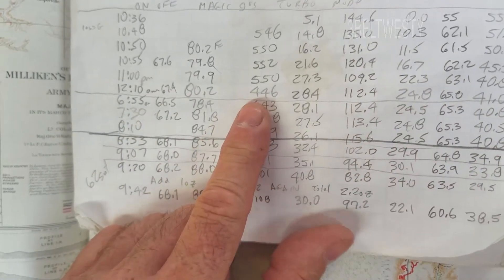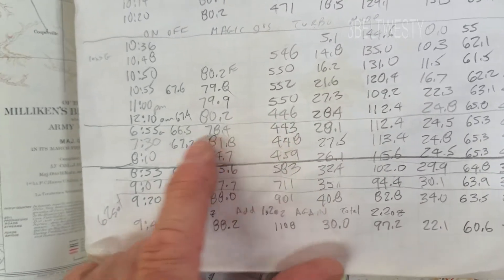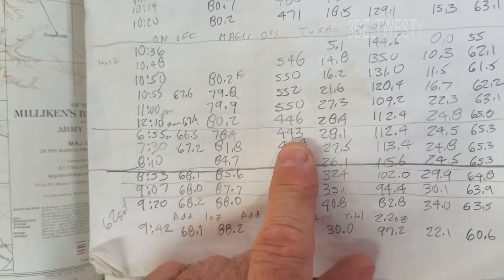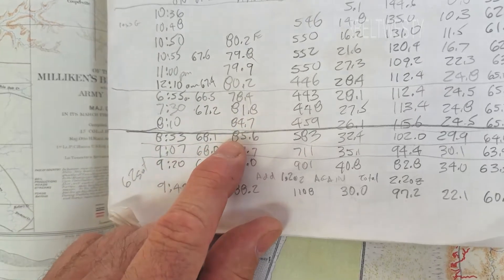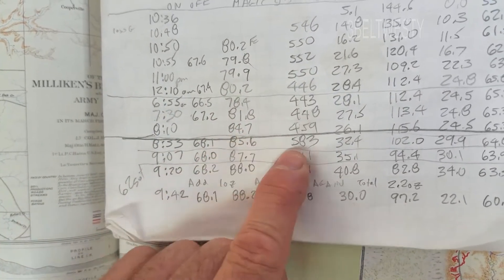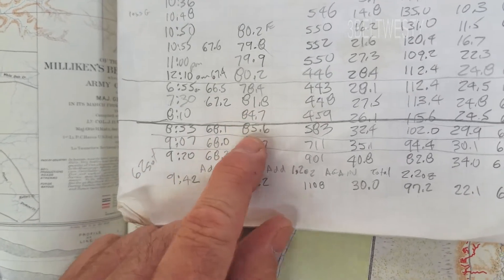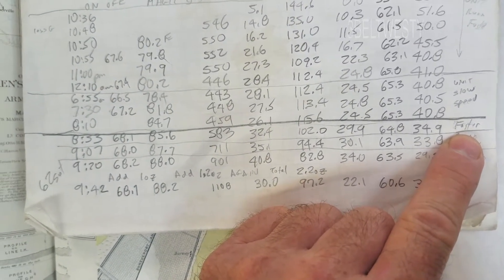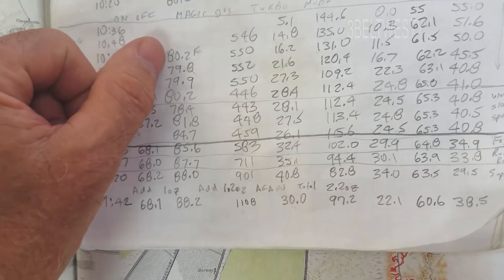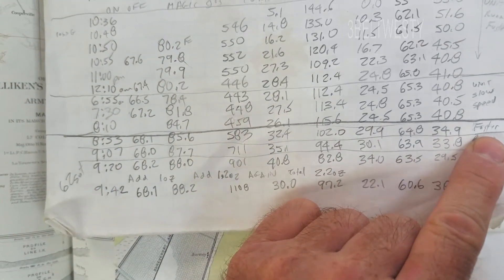The unit was very efficient at only 446 watts, but it's not full load. This morning at 6:55 it was roughly in the same range, and then by 8:10 the outside temperature had risen. By 8:53, when it ran around 84-85 degrees outside, the outdoor unit started running really fast. With this mystery brand, when the outside temperature gets above 84-86 degrees, it commands the compressor to go way quicker.